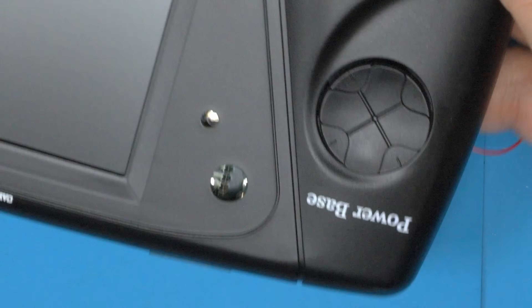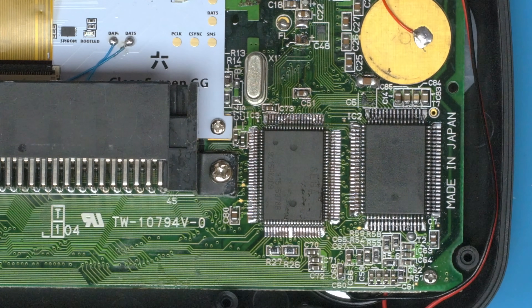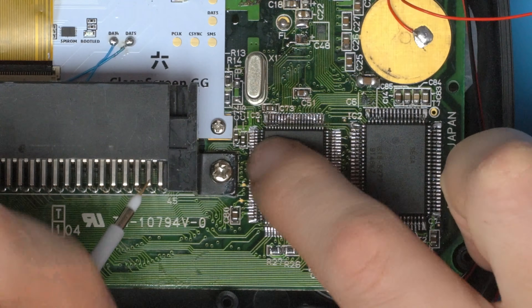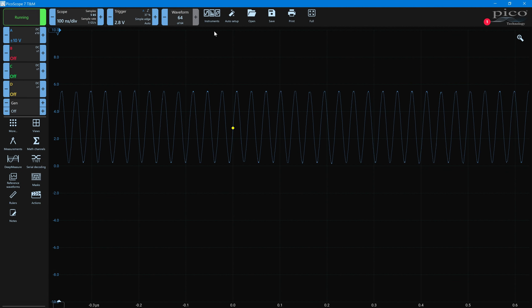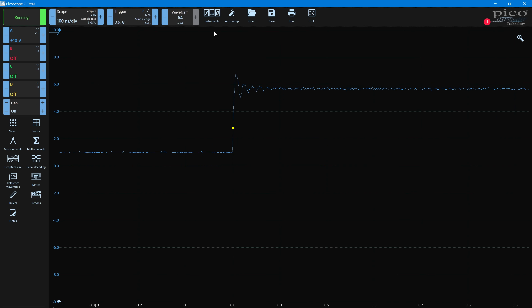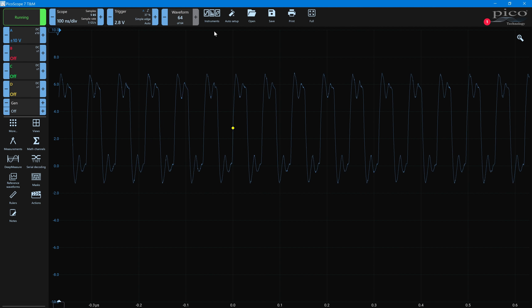And there we go — we have red light boot now, as expected with the new ASIC installed. So it was the ASIC. Now, scoping again: do we see those missing signals? XTAL1 is back, XTAL2 is there, C clock, V clock — all present. And the sample pin — yes, sample is there too. Every pin is now present and correct.